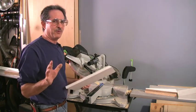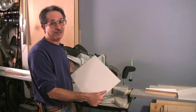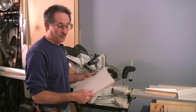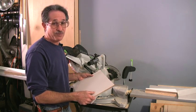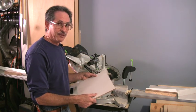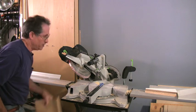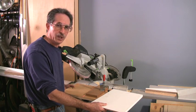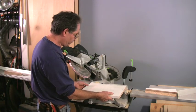This is a good example of what most of us would do — when you make these little corbels you're probably going to be tempted to make them out of the shortest scrap you have lying around. The trouble is when you're cutting small pieces you have a tendency to get your hand a little too close to the blade, and it can get dangerous. Cutting small pieces like this is really dangerous — it's the moment when you could lose some fingers or a big chunk of your hand. That's why you get hold-downs with your saw. You can also make a jig with a toggle clamp so you can get your pieces into the saw without getting your hand right up close to the blade.